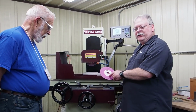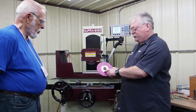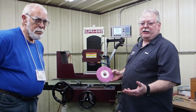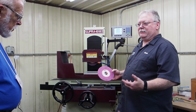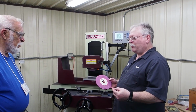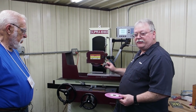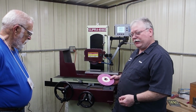We've got a video that I'm planning on doing where I'm going to use this wheel. And if a lot of you guys follow me, you know that the two biggest issues for grinding, in my opinion, are having a proper wheel for the proper job. So it's wheel selection, and then it's the dressing and truing. Those are the two biggest things. They'll compensate for a lot of errors.